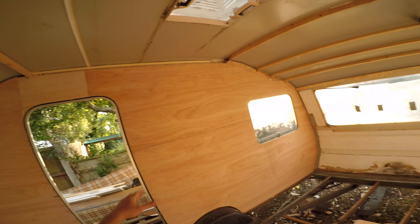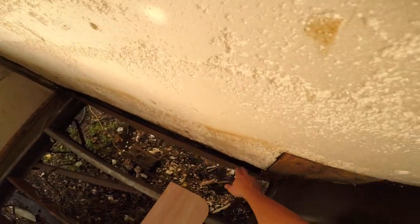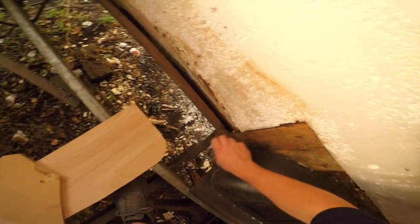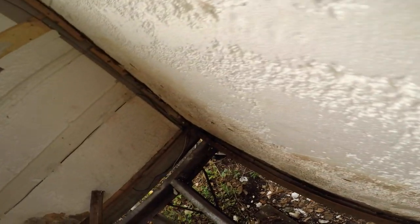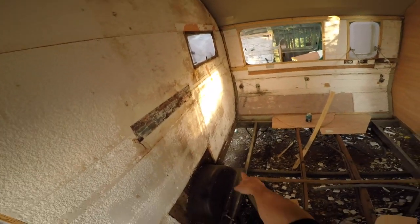As progress — we got all of this wall done. Paulina helped me and she took off all this wood from here, which is great. Still need to take off this side here, then replace this and replace that, and put the wall back. This is similar to what I did there, so I'm not going to film too much about it. It's the same process: take these screws off, take the outside screws off, see if I can keep this, take this wood off, clean it, glue it, measure the new wood, put it back in, screw it in.